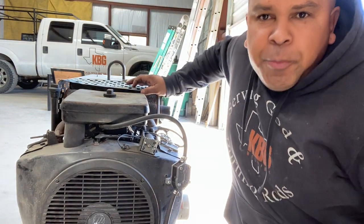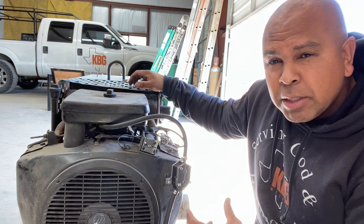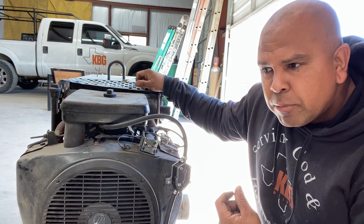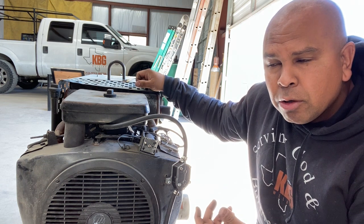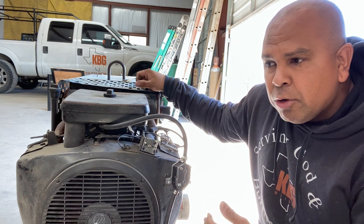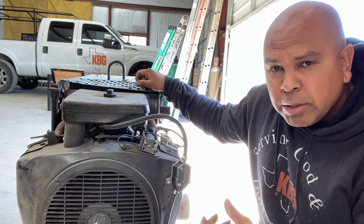All right, so that's how you change a fuel pump on a Miller Bobcat 225G. This was the first thing we wanted to look at because the machine wasn't taking a huge load. Generally we want to run smaller than a 1/8 inch rod when we're burning rods off this, but we do a lot of generator work where we're running our Miller 211 off of these, and we run the 220 so it can run continuously. We're not worrying about it cycling down, but that wasn't happening. We actually had 3/32 rods that we run off this, and we weren't getting power. It was going down continually.